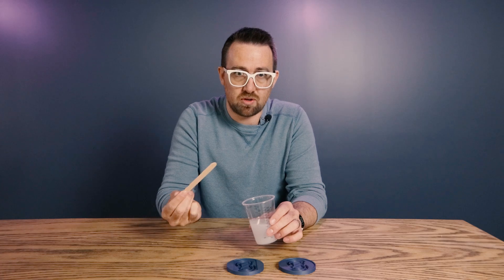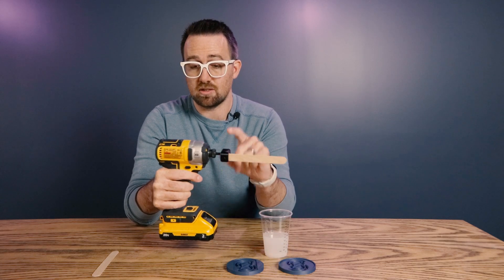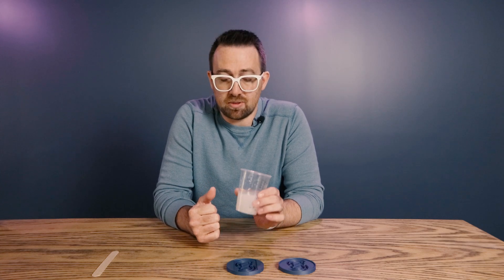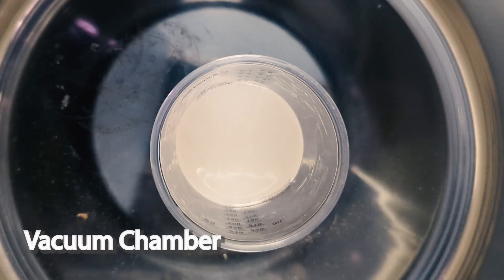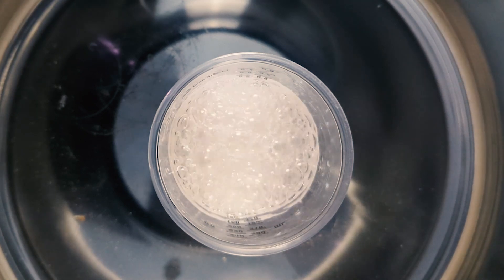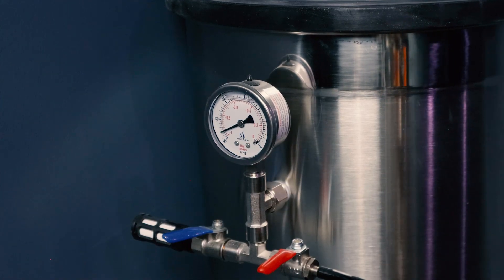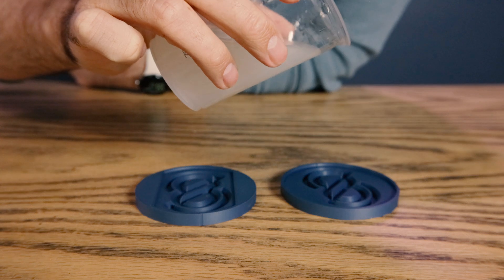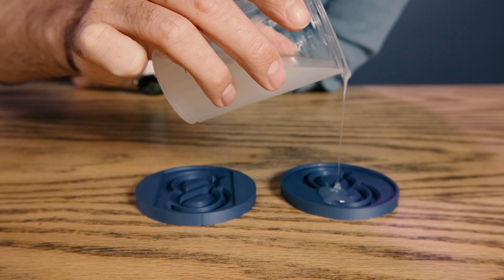You can just hand stir this with your typical stirring stick. I typically like to use my drill attachment that I designed, which you can find on the website — the link is below. This just makes it easy to mix. This is technically a bubble-free mix so we can pour directly in. However, especially when using the drill, I like to put this in the vacuum chamber so it can release any bubbles and degas the whole thing. Then all we're going to do is try to get a very thin strip of silicone into the deepest parts of the mold first, which will help prevent any air bubbles from getting trapped.